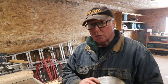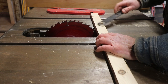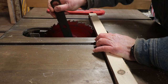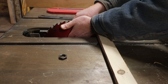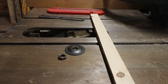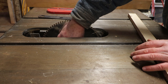I'll install this and show you some of the special things I do when I change blades. The first thing you want to do is remove the throat plate and set it aside. Now we need to remove this blade - take a scrap piece of wood for the blade to bite in, then take your wrench and remove the nut. We don't need this blade, so we're going to put our nice finishing blade on. Slide it over the arbor, put the washer on, and then put the nut on the arbor.